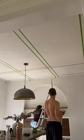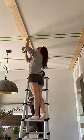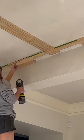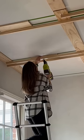Elevate any room with your own DIY coffered ceiling. I started with tape to make sure that I liked the grid and the scale of everything, and then I used one by six boards for the width I wanted and then one by two boards on their side for the depth.